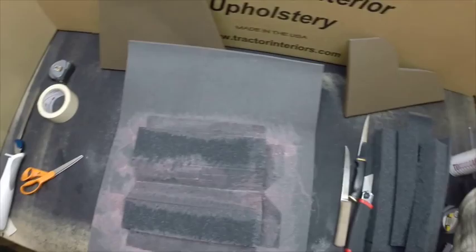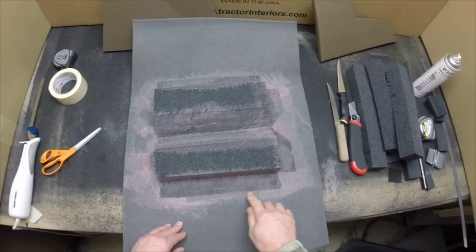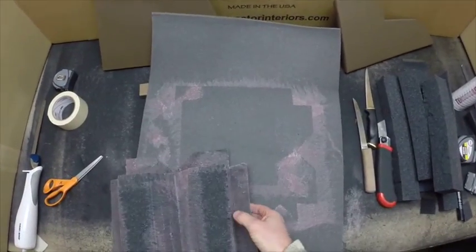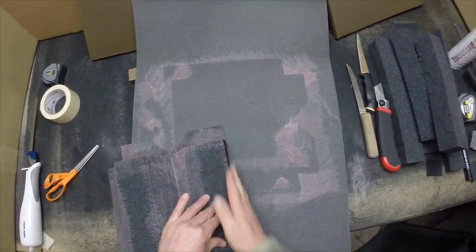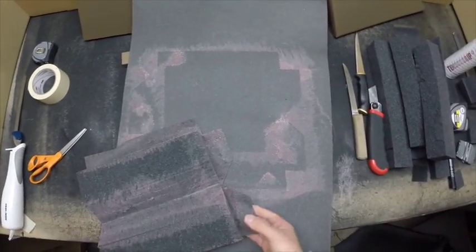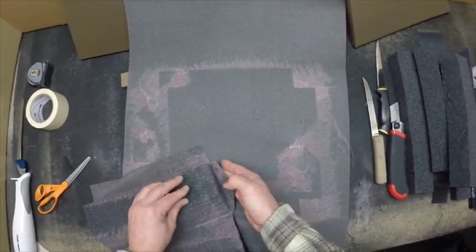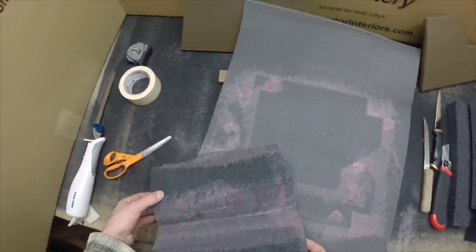In the center, it isn't going to make much difference because it's going to be held throughout the rest of the area, but you do want to make sure you have good adhesion on these finished edges that you just fold over, because if they're not finished well, that gives it opportunity to start coming loose and then peel off. So as long as you keep those edges stuck well, it's pretty important on these rolled edges, these folded over edges or finished edges. But the V cuts, it's not quite as critical, because they're on the inside of the part. You don't see them.